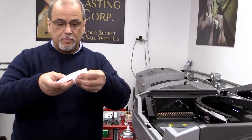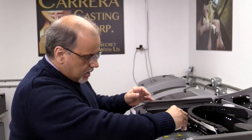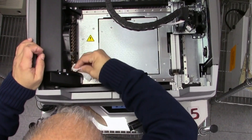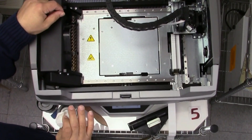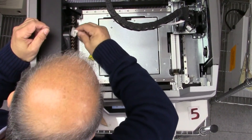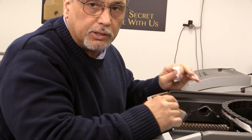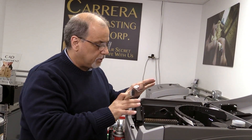After the q-tip, fold up the Kimwipe. I don't want anything sprayed into the machine, so I spray it very little — away from the cutter, not into it. Just clean it a few turns and you're good. This cutter is ready to go. If we can get a close-up, you'll see it's very shiny and very clean. Clean around the opening. If you see particulates inside, go back and flick them out. You don't want buildup — once it builds up, it will coagulate into little rocks and tear your build parts to pieces.